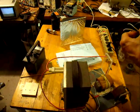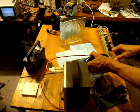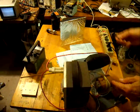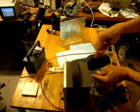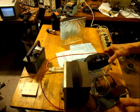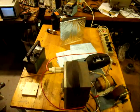We'll stick the tube into the housing, which is made out of a lead-filled plastic used to eliminate all stray radiation. We've got a screw that goes up and catches the screw in the end — we'll have to get it lined up. Now we've got our high voltage wire hooked to it, and the filament wires hook up with these little quick connects. We're going to aim that right into the fluoroscope. Our beam will go right straight into the fluoroscope. We've got a video camera hooked onto it with an image intensifier, so it gives a pretty good image.